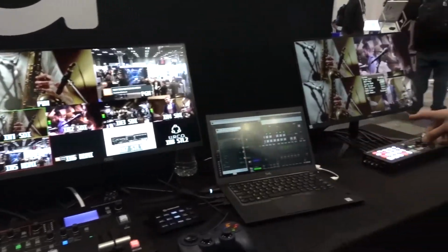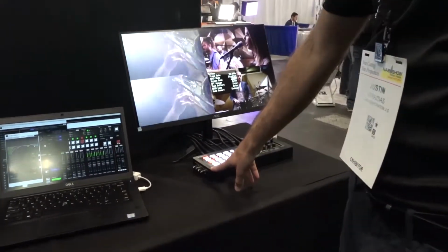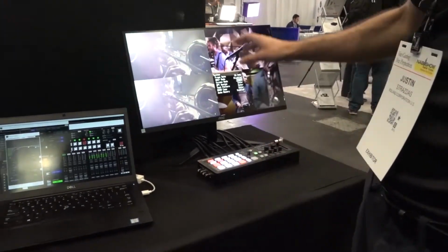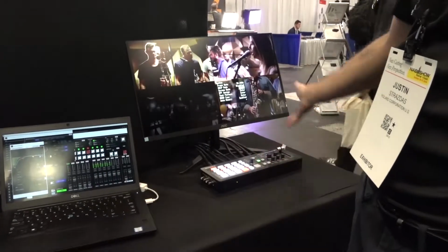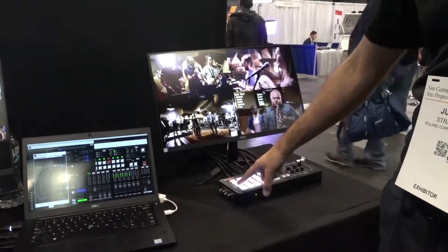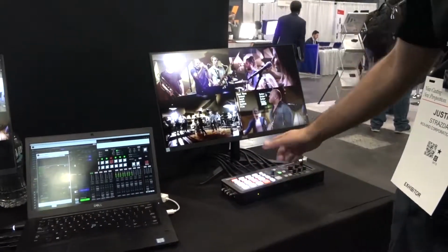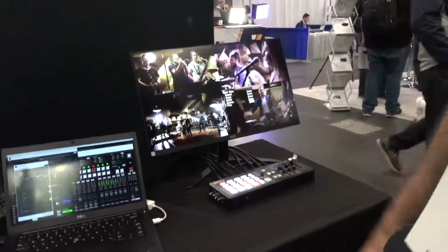And finally, we have the XS1 HD. It's a combo matrix and program preset switcher. So there's multiple modes. So you have 4 scaling inputs and the flexibility to go between a 4 in 4 out matrix mode or a switcher mode where this is program, this is preview, this can be picture-in-picture or an aux output. So it gives you a lot of flexibility if you're bringing it from production to production.